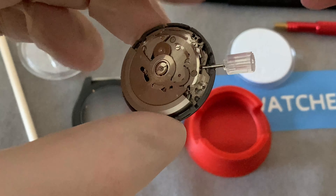Now let's bring the movement back in. We are going to put the dial onto the movement. I find it a little easier sometimes to pick things up and use tools without the glove on the right hand - but that's just personal preference. There are two pinholes - those two pins that were still there - that's what we're looking for. It's gone in. So you can see now it's nice and flat up against that grey disc at the side of the movement. Now we have a dial on the movement - you don't need to glue it or anything.